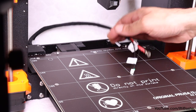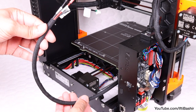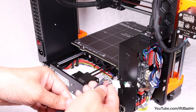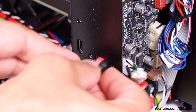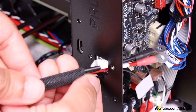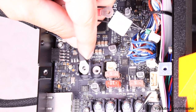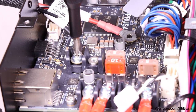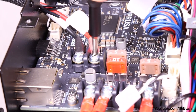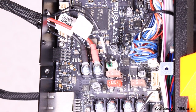So with our heat bed now securely in place, we'll go ahead and get the heat bed cables plugged in and finished off. Around the back side of the printer, we have our heat bed cables complete in the textile sleeve, as well as the nylon filament inside, which guides the cables up and away from other components. Begin by pushing all cables through the square opening on the rear side of the electronics chassis. Note that the filament pokes through the circular hole right below the square opening. Place the black heat bed cable on the left terminal, just above the power terminals, and secure it with the terminal screw. Likewise, place the red heat bed cable on the right terminal before securing with the terminal screw. Finally, connect the heat bed thermistor cable to the electronics board into the port just beside the red heat bed cable.